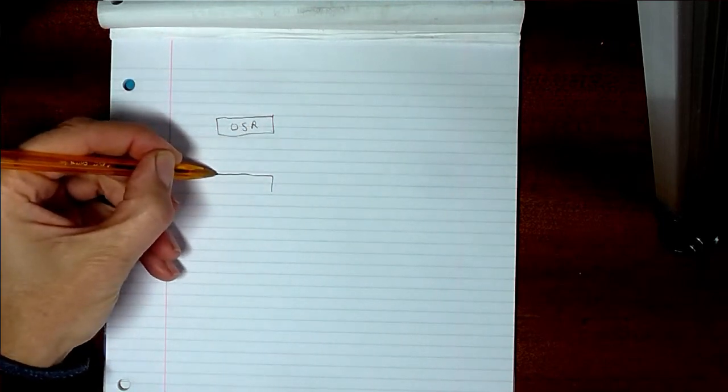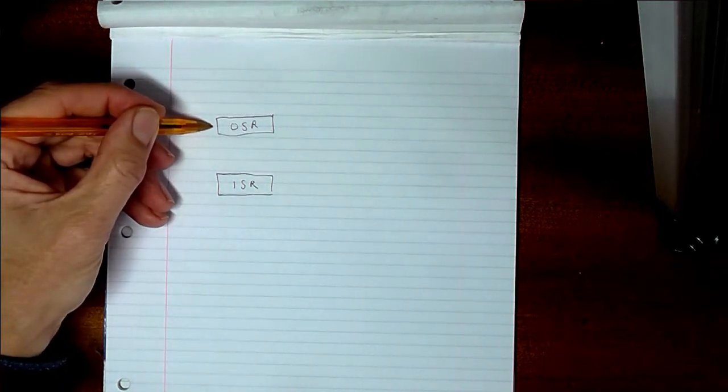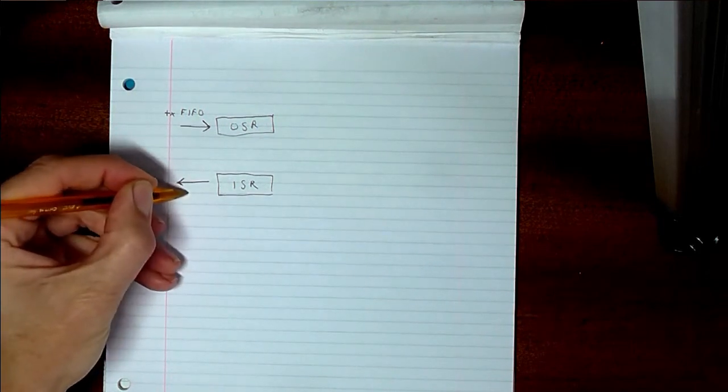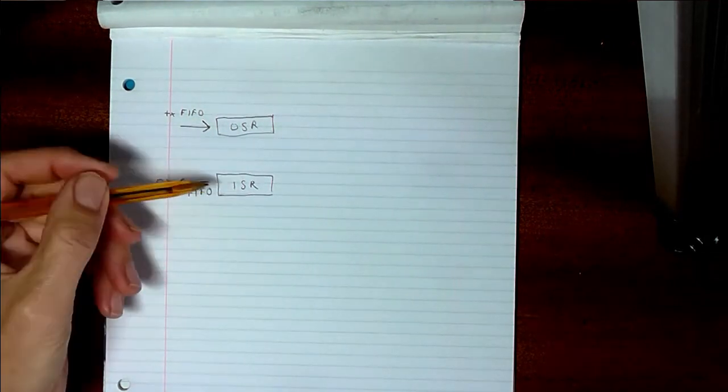So in order to program the programmable I/O effectively, it's good to have an understanding in your head of how it's structured and how its structure relates to the operations that you can perform on it. You've got an output shift register and an input shift register. These are connected to the main CPUs, either if you're running code on the CPU itself or if you're using an interrupt routine, by two FIFOs. The output shift register can get information from the main cores through its FIFO, which I think they call the transmit FIFO. And the input shift register can send information through its first in, first out queue, and that's called the receive. It's a bit confusing that it's called the receive, because I guess the computer receives information from the input shift register, and the main cores transmit information to the output shift register.